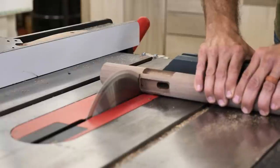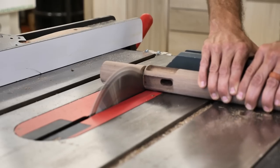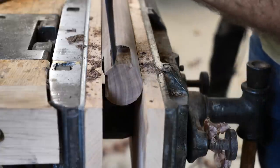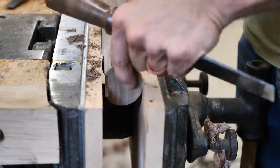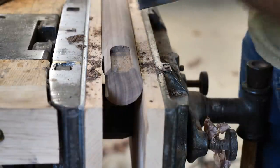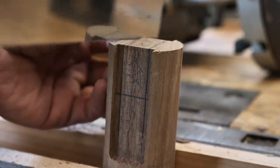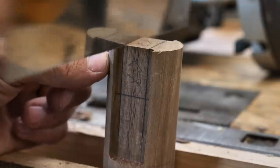So I'm cutting right on the top of those mortises, and then we'll come back with chisels and clean it all up and get those edges straightened out. It's a cool looking joint. I like the way it looks. There's going to be a lot of hand tool work in this piece, in instances where doing it with a jig would take a lot of work, and I feel fairly confident that I could do it by hand. This is somewhat of a half lap happening here. We're cutting out a section of waste for that front rail to slide over and slip into this part.